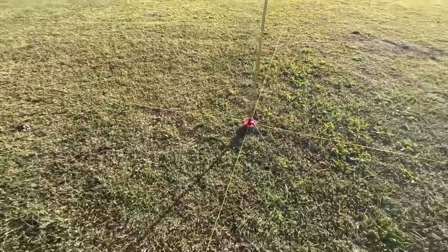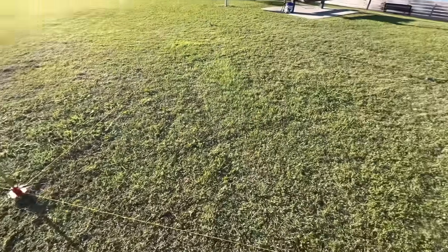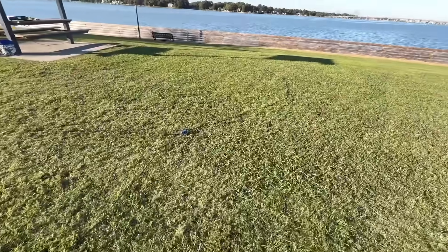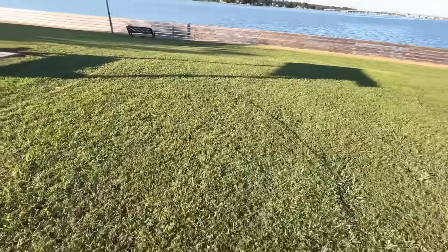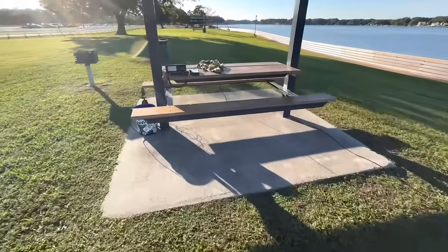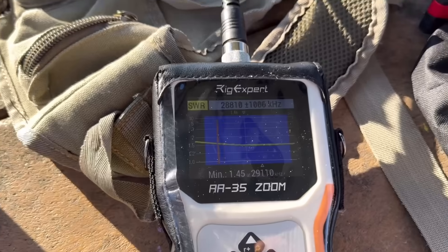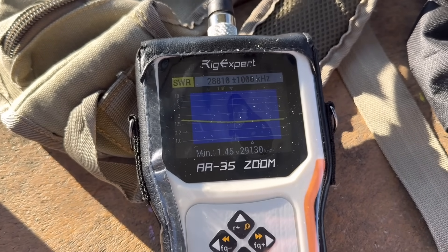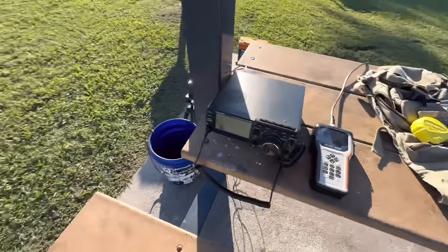These are tuned for the 10-meter band. I literally tuned them individually with my 50-ohm coax first, then put the harness on and tried to get it dead center. The 50-ohm coax — about 30 feet of it — runs over to where I checked it on my RigExpert. And holy cow — good result! I'll take it. It's not perfect, it's good enough, and that's what I wanted.